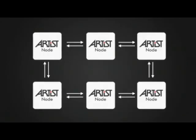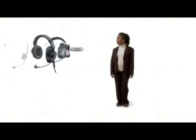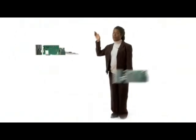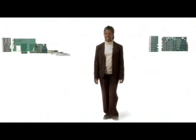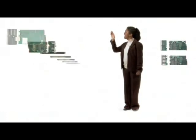You just expand the system by adding a second, third, fourth, fifth, sixth frame to one fiber ring. It's that simple, really. So what else do I need? Yeah, a Cat5 client card to interface my panels. Of course, I could also have chosen a coax client card because all Riedel panels have both possibilities, Cat5 and coax cable for people who can't decide. However, I also need to connect some analog 4 wires and some AES digital signals into my intercom matrix. That means I'm going to need an analog client card and an AES client card.